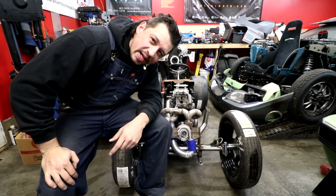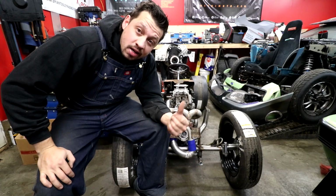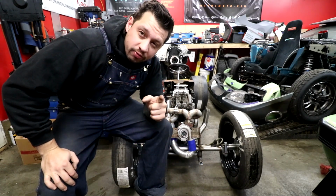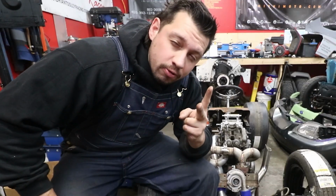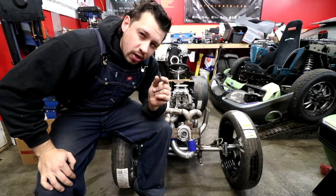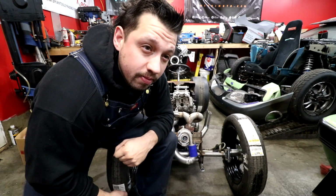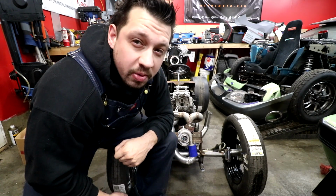It's hard to compete. Anyways, we're back with our turbo lawnmower thingamajiggy. We're gonna try and get some chains in this thing. I bought some 520 chains for my 520 front sprocket, but it's a 530 rear sprocket, so I think I have to narrow it. My limited research time on the internet says it's just a wider sprocket. I might be wrong again.